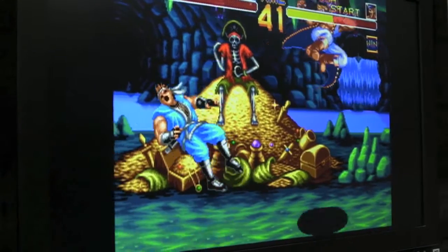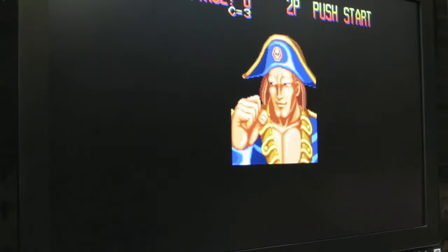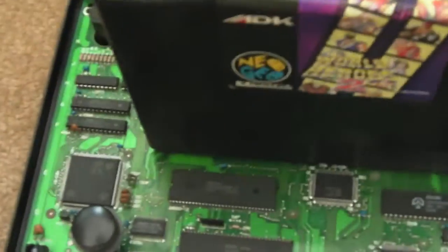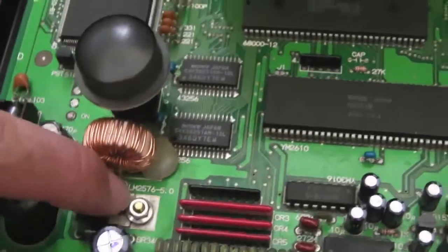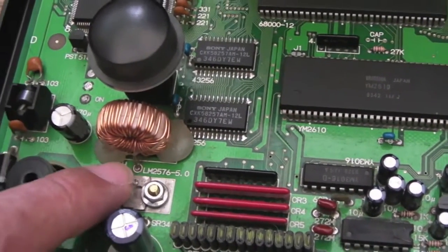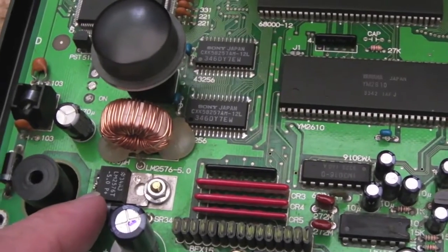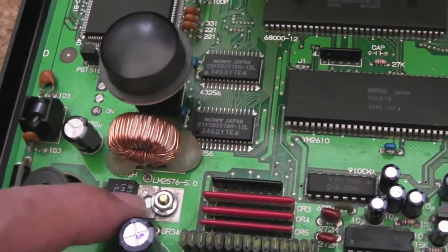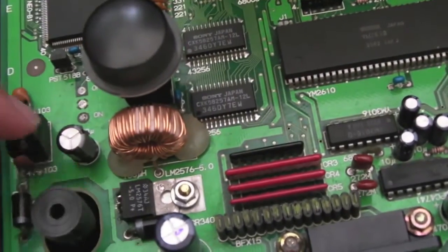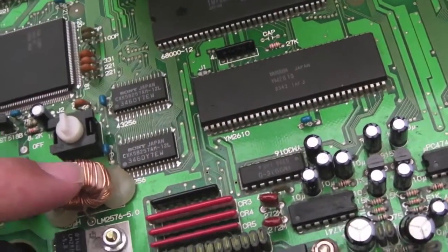The next thing I'm going to do in the next video is the ROM fix. And then the final thing with the regulator - I've ordered a brand new regulator. I'm just going to swap it out. Where the heat sink uses the board as a heat sink, that screw mount is not in the right place. This does get warm. I'll unscrew it, take the thing off, put a brand new one on with nice new legs. Put a tiny bit of thermal heat sink compound under the base for better thermal bond with the board. Then re-solder it using my hot air rework station on a low temperature setting.